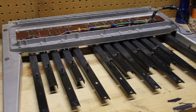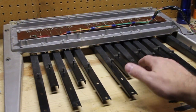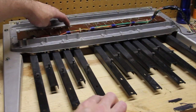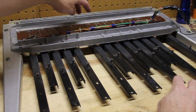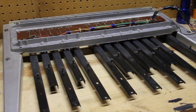I got it all back together. As you can see, I've removed all the keycaps. At one point I made a little mistake and broke free one conductor, which I had to re-solder, but I got it back on. Testing it out — we got two that aren't quite doing it. It doesn't sound like there's anything intermittent; this must be a problem elsewhere, because everything else is working just fantastic. See when it meets it does well — the contacts are clean.